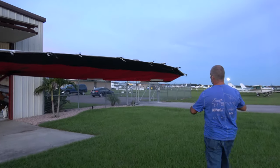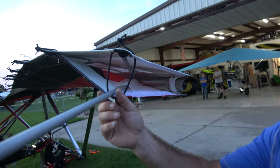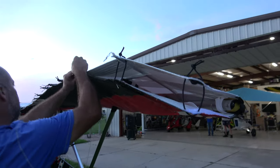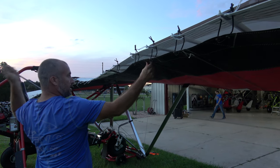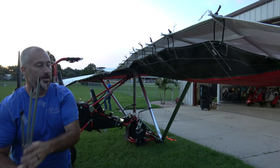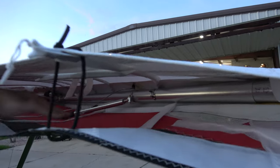We always want to start with the tip batten. Let me show the tip batten — you have a dual tip batten on this wing, one on the bottom and one on the top, which is totally different. This one folds and when it straightens, don't put your finger here. Now undo the bungee cords and go ahead and pull these undersurface battens out. With a single surface wing, you don't even have undersurface battens — and you certainly don't have this many upper surface. Bring that sprog in, inboard sprog holds out.